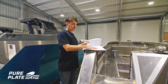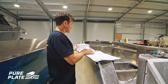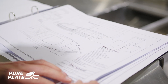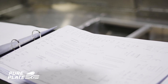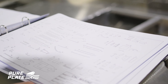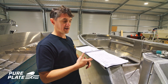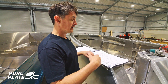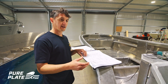If we go through the drawings you receive, you'll get a pack with your kit. There's a GA drawing you've probably already seen. Your next drawing is the plate expansion — it has every single part on it with its part number. A good idea is to mark them off with a highlighter and check you've got every single part before you throw away any scrap, because you can easily toss a small part without noticing. It's also good to check that everything actually came with the kit.